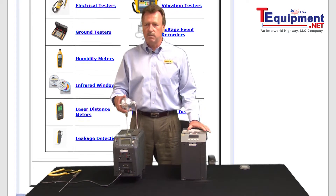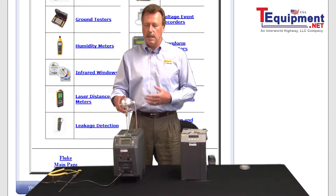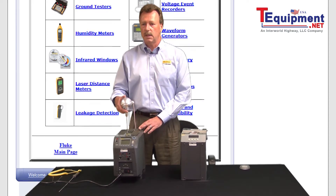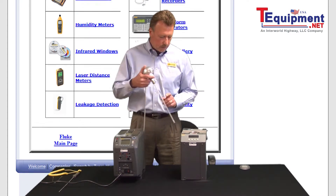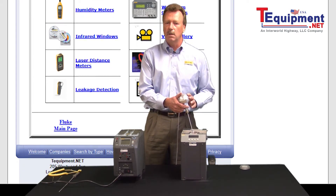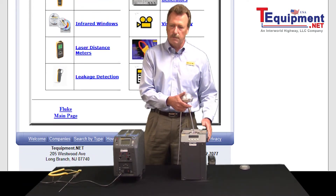Can I carry around an instrument that has some fluid in it, or do I want to go with something that does not have the fluid? It's a more dry application, but maybe limited to the number of sensors that I'm going to be able to calibrate at one time. And obviously with the liquid bath, as you can see, we can put these at different angles and calibrate quite a few more transmitters or any odd-shaped temperature probes with this device.